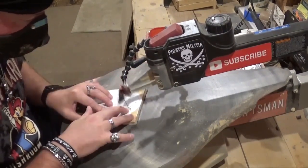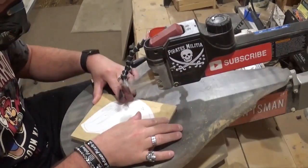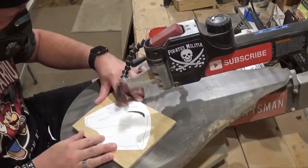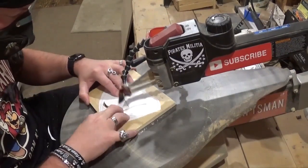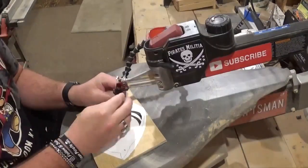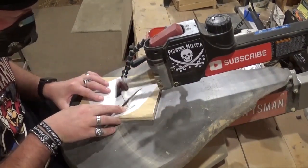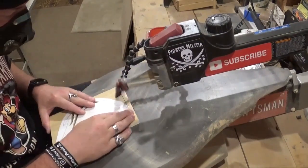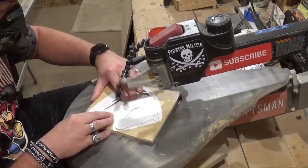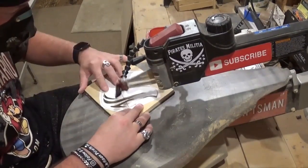The hardest cut I'm actually doing now is the horse's eye — just taking my time with it and letting the blade do the work. I am using number five ultra reverse tooth blades for all the cutting on this project, and they are cutting through the material exceptionally well with minimal chip-out. I use the Shark Tooth brand scroll saw blade — I think they are a quality blade that cuts a lot of materials very well. This pattern is available as a free pattern download over at stevegood's scrollsawworkshop.blogspot.com website in his free pattern catalog.